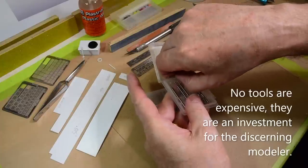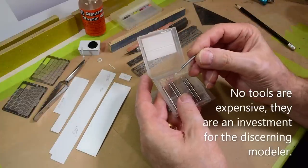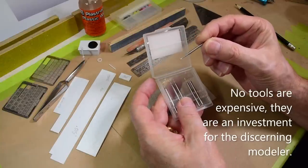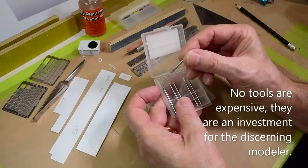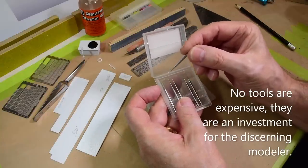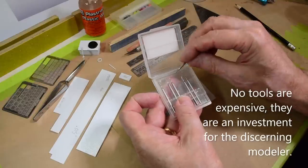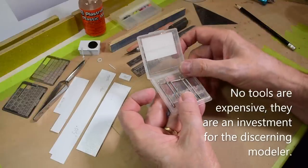And then this is a little diamond drill bit from Dremel, which is a must-have. It's shaped almost like a step drill, and it's just fantastic for honing out an oddball size hole, I find. Like, just with your hand, like that. Okay? So I really like those.